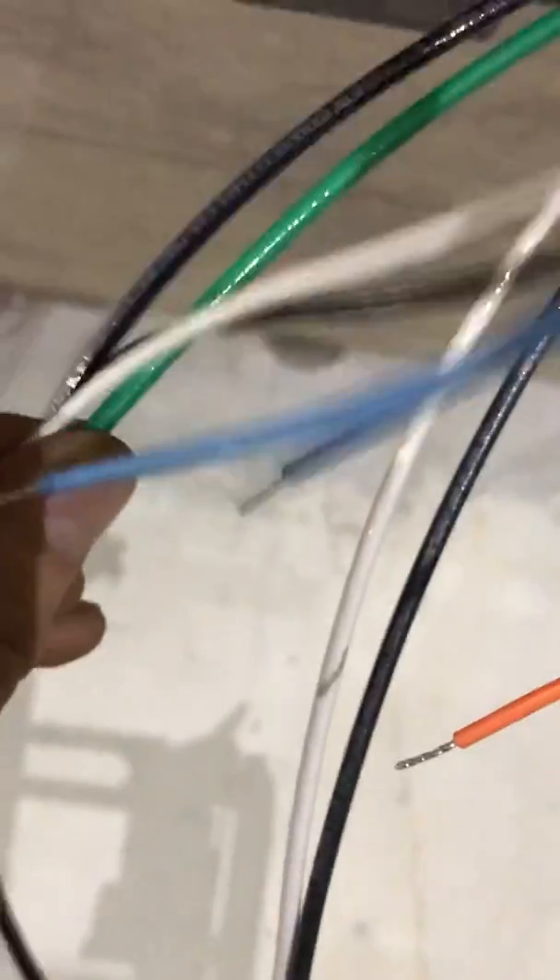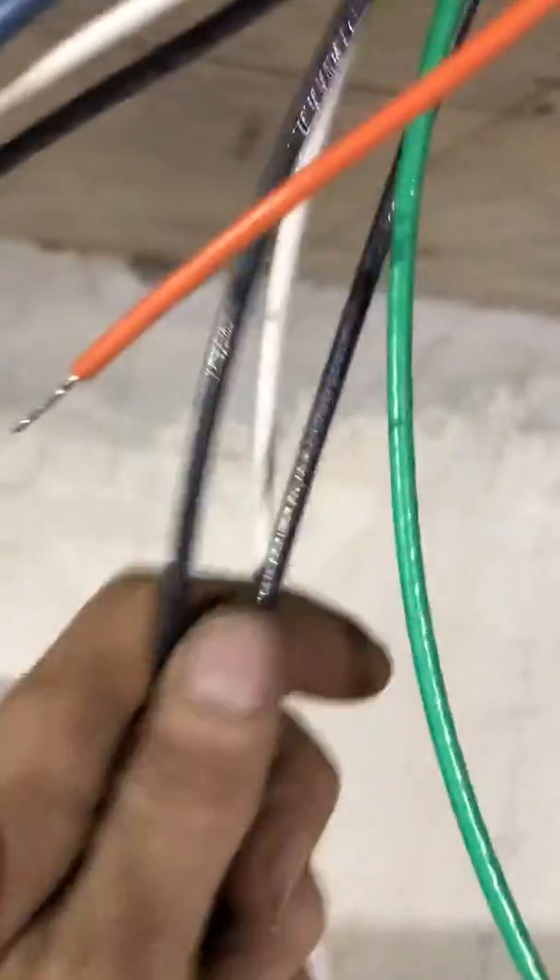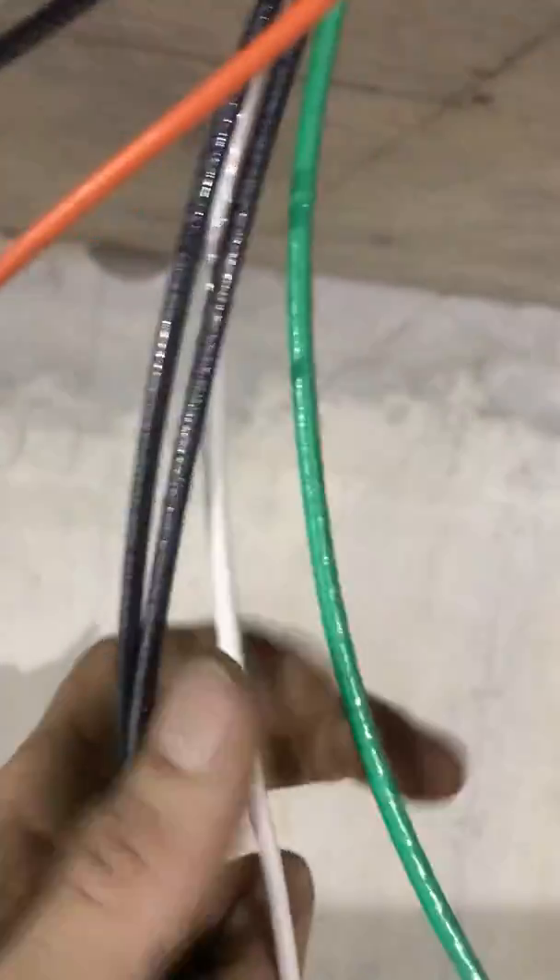What's left on the power pack side is the white, which is your neutral. Coming out the other side of the pipe I have wires going to the light and my feed — two black wires, a white wire, and a green wire. That's what's going to feed it and ultimately provide the switched leg that feeds the lights.